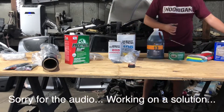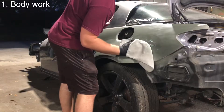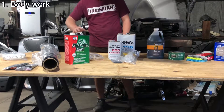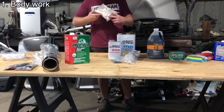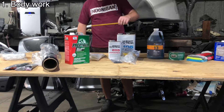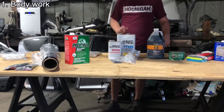We're doing carbon fiber today. The first section is obviously to do the work — make the part or the plug very straight and very clean. There are multiple ways to do carbon fiber. There's what I'm going to be doing, especially on the quarter panels, which is hand laying carbon fiber. There's vacuum infusion, tons of ways to do it. But first, the easiest is just using some paint brushes and resin to lay it.